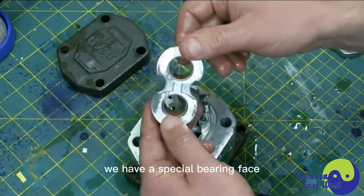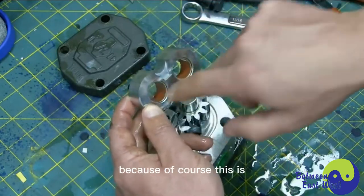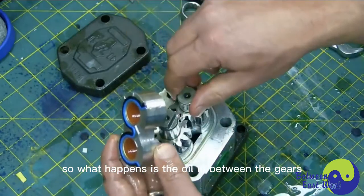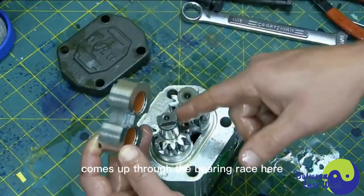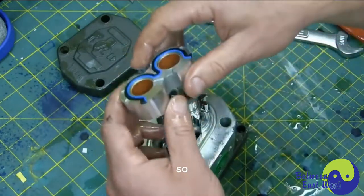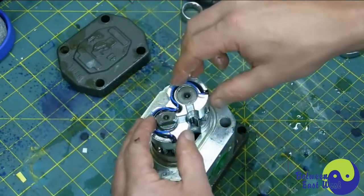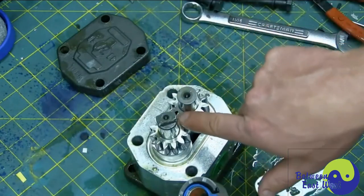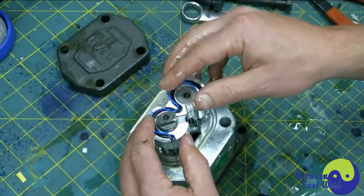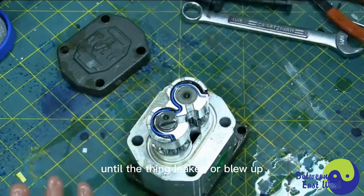What we do is use a special bearing face — this is a DU bearing, essentially a Teflon bushing. That lasts an extremely long time because this is pressure-oil lubricated; there's pressurized oil in there at all times. What happens is the oil in between the gears comes up through the bearing race here, and then there's a gallery, and it goes directly back into the inlet. That keeps the low-pressure side sealed from the high-pressure side. Any bypass leakage from the middle of the gears goes up through the bearing surfaces and back to the inlet. That's extremely important, because if we didn't have this, internal pressure would build until the thing leaked or blew up.